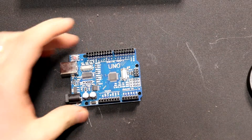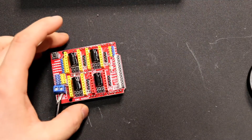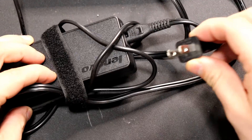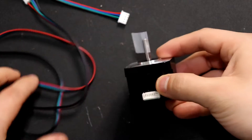For this project you'll need an Arduino Uno, a CNC shield compatible with an Arduino Uno, a serial cable for connection between the computer and the Arduino, a DC power supply between 12 and 24 volts, some stepper motor controllers, and of course your actual stepper motors.